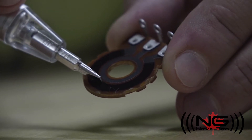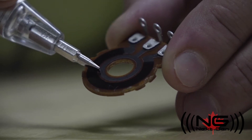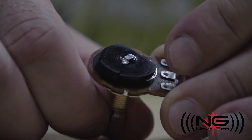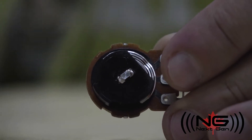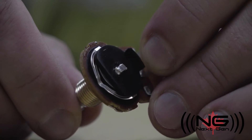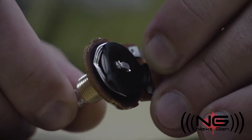The amount of carbon material is what determines the total resistance of the pot. The thicker the carbon, the less resistance. The thinner the carbon, the more resistance. The wipers move across this carbon ring and make a connection across the two rings. The position of the wiper determines what portion of the total resistance is divided between the center lug and the outer lugs. This is why potentiometers are known as variable resistors.